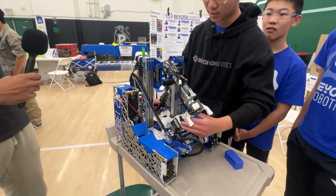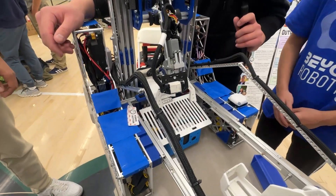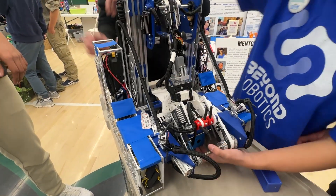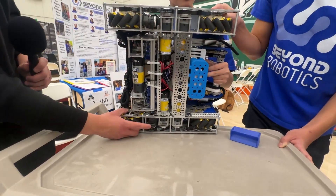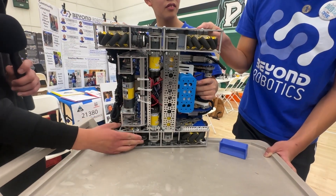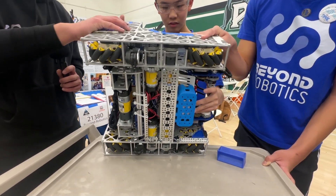About our localization - under the robot we have two four-bar GoBilda odometry pods. We have our perpendicular pod and our parallel pod, and we're running two-wheel with IMU, but our IMU is a Pinpoint odometry board.